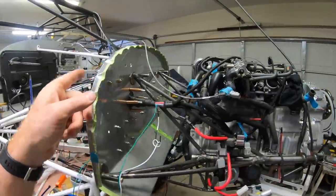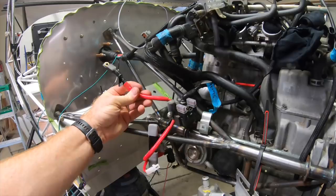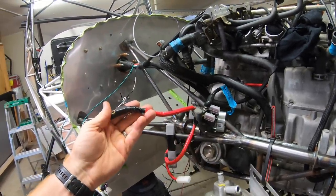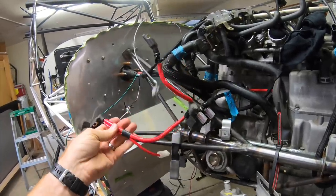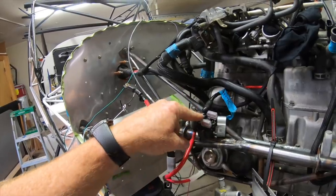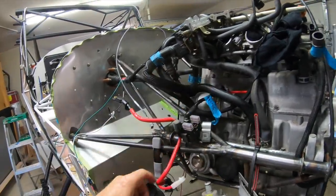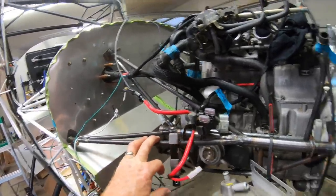I will come off the battery direct to the starter relay with an 8-gauge wire. This is the wire that comes on the sled to the battery. I'll be making a new wire that comes to this post to go to the starter. I've got the wire for it — I'm just waiting for some 8-gauge ring connectors.